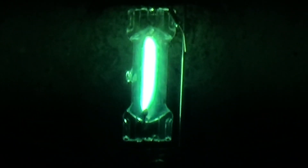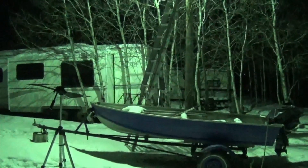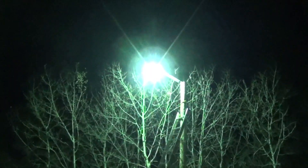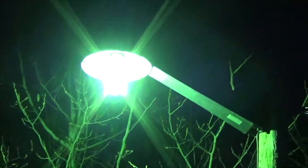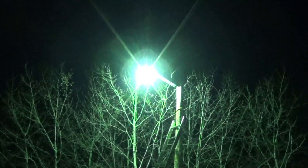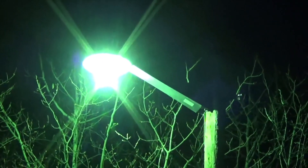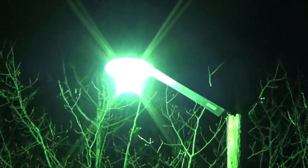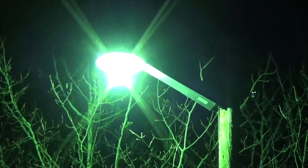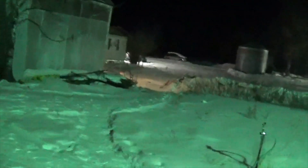The arc is not moving around at all anymore. Of course, that's just more questions than answers. Now I'm wondering, did something change in that transformer, and now it's not causing that unstable arc and it isn't humming as much anymore? Or was the arc tube just upset because of all the vibration coming from that transformer? Now that it's all warmed up and everything's expanded and tight, there's just no more vibrations, and it allows the arc to burn properly. You wouldn't think a bit of vibration would upset the arc that much, but I don't really know lots about these lights yet.